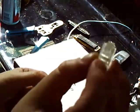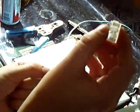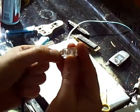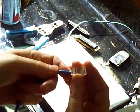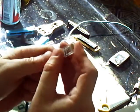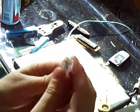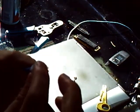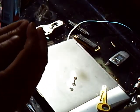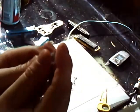I've got the connector here with the pin on top. I always insert it upside down, so white-green goes on the left when you're looking at it upside down. I push it in there making sure the color code doesn't change, push it nice and solid. The wires are going in enough — I can look at the tips and see the copper touching the RJ45 contacts. I check one more time: white-green, green; white-orange, blue; white-blue, orange; white-brown, brown. It's good.